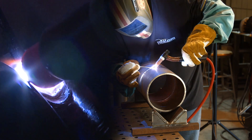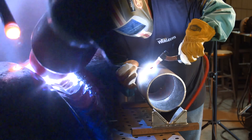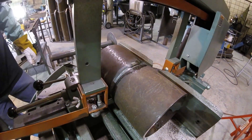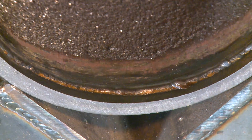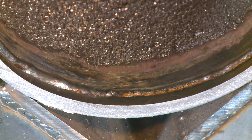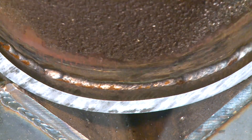Up here on top, I tend to weave a little bit wider. We finished up. I went ahead and cooled this off, saw cut it, and got some B-roll on the inside. I noticed one spot that had a little bump to it. I'm thinking that's where it was wide open — a little transition right there. It's nice and blended, but it is just a little tall. The rest of it had some good profile, especially where we started out.